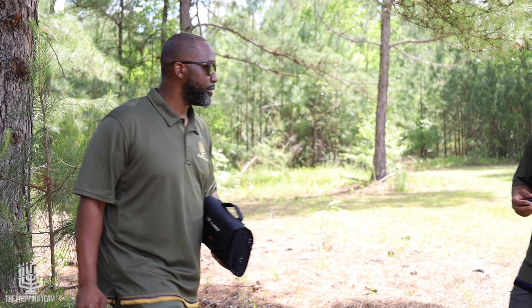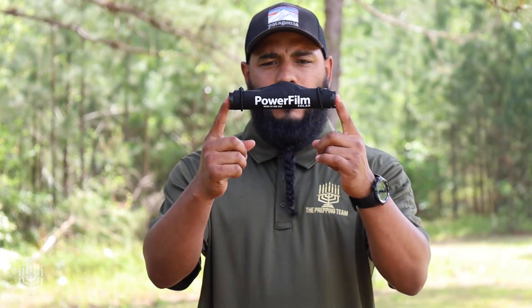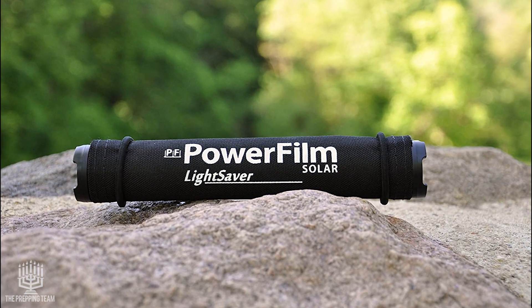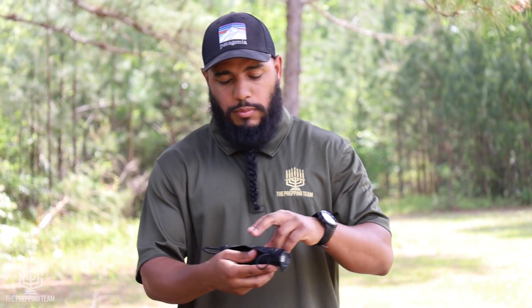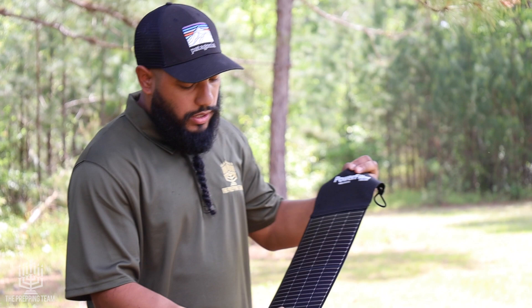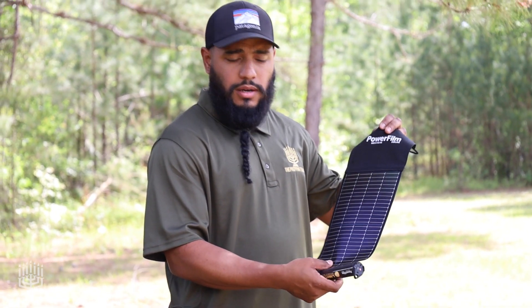On the flip side, something a lot lighter — it's about seven or eight inches wide and only weighs five ounces. It doesn't put out as much as any of the other ones. This is actually a PowerFilm solar panel. The other ones are monocrystalline; this is a film solar panel, so you're able to flex it. It's more forgiving — if you drop it or step on it, it's completely fine. These film solar panels, even if punctured, will still work.